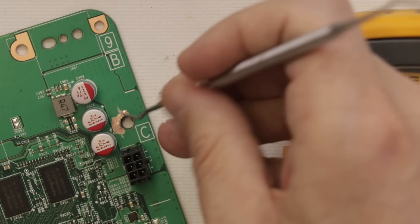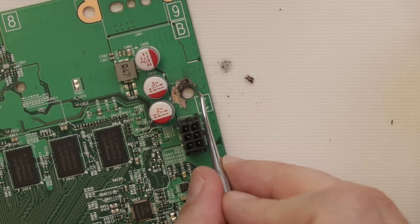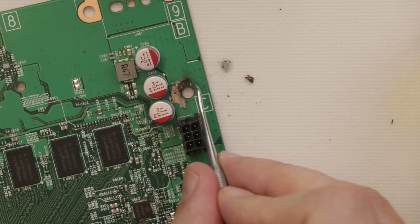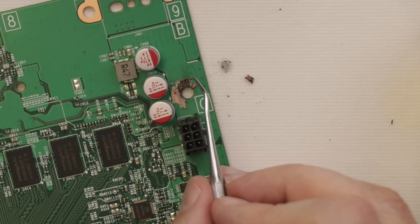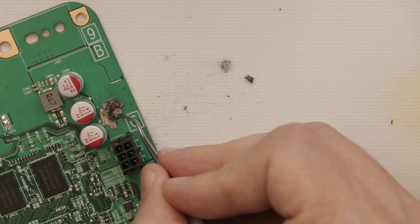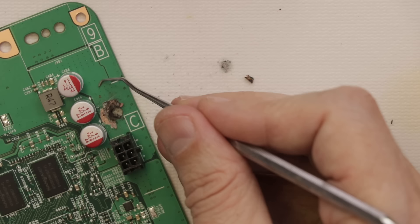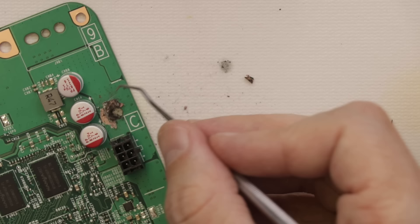Look at how blackened that is. I've been peeling back this top layer more and more — there's another layer here and possibly another layer down below. I need to peel this part back more until all the black stuff is gone, because there's obviously a problem right in here where all the burned marks are. I've got a lot of burn marks even under this second layer, so I need to clean that out and peel away more of the top layer to get down to the source of this burning. There must be some sort of defect down in here.